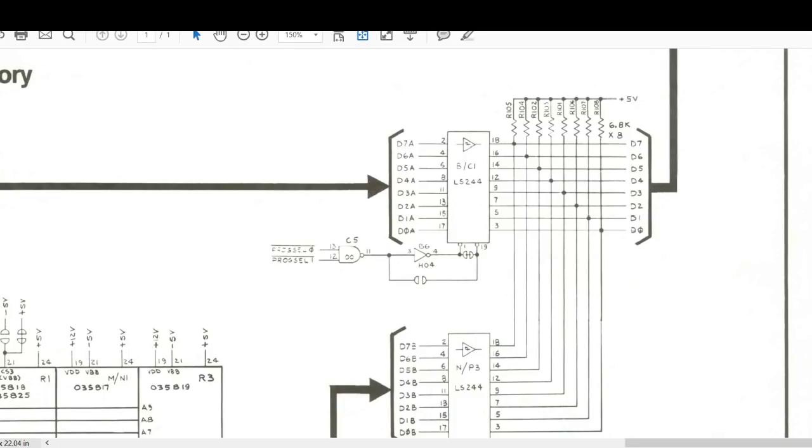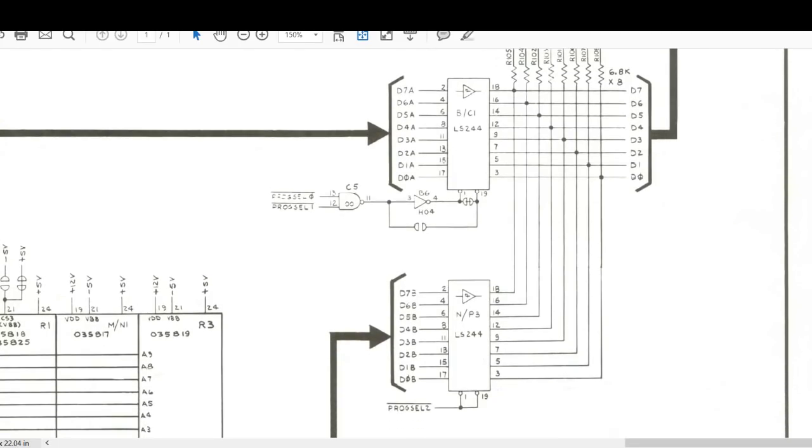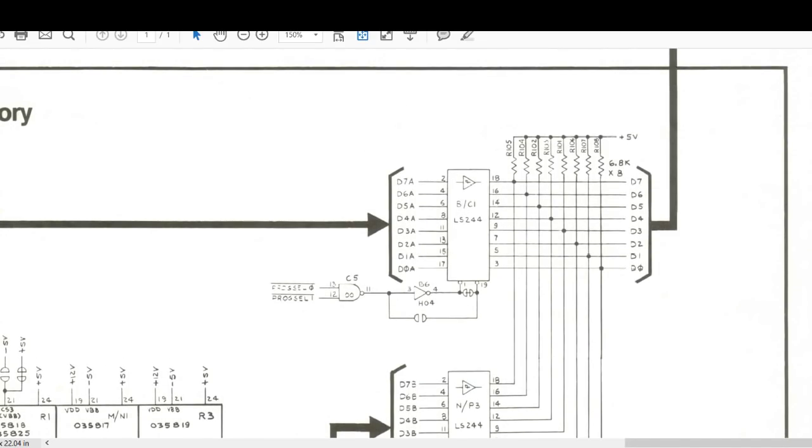That would do it. Because it had... No, it wouldn't cause them to short together. I don't think that. Where is that SIP resistor pack there? That SIP resistor pack that it's talking about. Where is that? These are R105, 104, 103. Right, okay. So let's look for those resistors, if they're loaded on the board. They may not be loaded. They say that it's next door to BC1. I've just pulled BC1 out of the socket, there are no resistors. There's no R110, whatever it is, there. No, that SIP resistor pack is not present on this PCB.